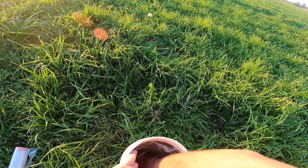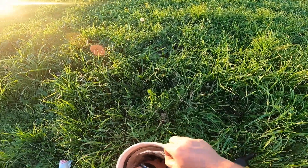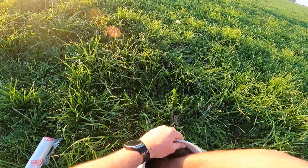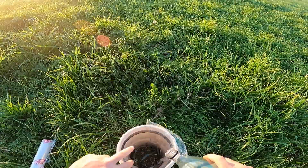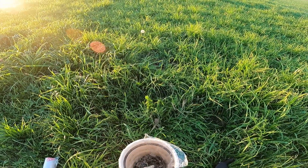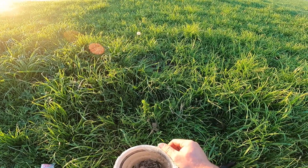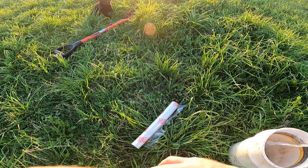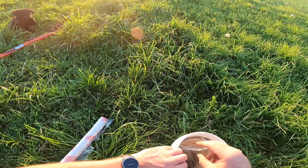That's going to hold an accurate amount of water. This is why you'd ideally go with a slightly shorter infiltration ring — nevertheless, that's what we're after. That plastic wrap is going to hold our water. We're going to pour our water up to that line we created, nice and gently, making sure our plastic wrap is holding. Now we're going to look at our stopwatch and press start.